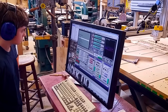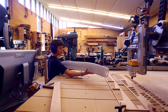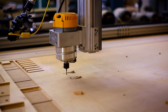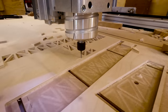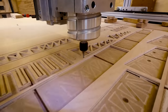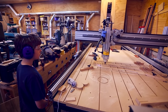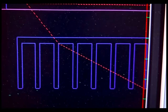Once we had that, we could start cutting out pieces. With cutting out all of these trusses, we cut the center pattern first. Then once that was cut, we could cut the truss out of the sheet of plywood — because if you cut the truss out first, there's no way to hold the piece to cut out the holes in the middle. And it was a lot of watching. The CNC machine is very noisy and slow, but fun to watch when it's cutting out something interesting besides triangles.